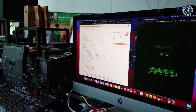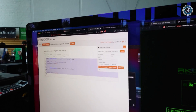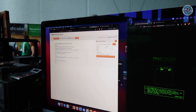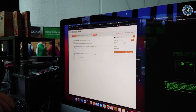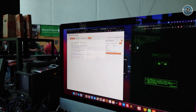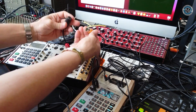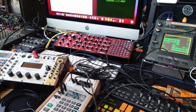Here you can see the code it's made of. I can choose a simple one — like this. This is a very simple piece of code. The RK2 has the whole system for collecting MIDI messages and already does the hard work on processing MIDI, so the only thing you have to do is just intercept MIDI messages. For example, here I have a Note On message, and whenever it receives a Note On, it will send a Control Change on the same channel — controller one — and the velocity value will be sent to controller one. That's a very simple modifier you can make, but you can expand on it a lot. You can even use the pins on the DIN5 which are not used for MIDI — you can use them for switches or you can even generate video on it. It's really a little toolbox cable.